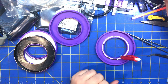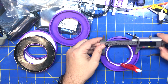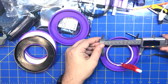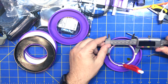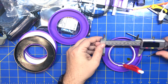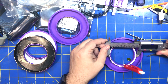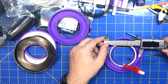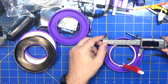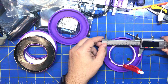These big spools are at the maximum of my bed. They're hard to print. They are pretty much edge to edge on my bed. I have a very small printer. It's only 110 millimeter across. So I'm trying to see what kind of size a small spool of tape takes up, trying to get some calculations. And I think I wound up picking a width of maybe 90 millimeters. The big ones are about 110 millimeters.